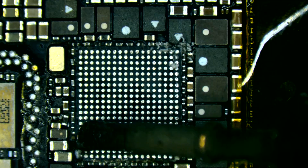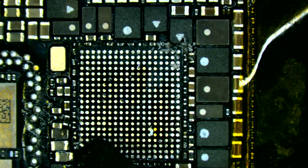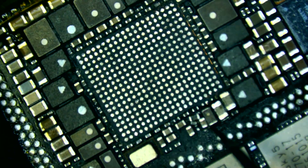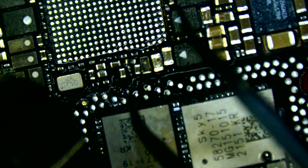Using PCB cleaner or even isopropyl alcohol with a brush and a microfiber cloth, you'll be able to clean up any of the flux residue to leave you with a nice clean surface that the IC can be soldered to. Then you want to take the time to realign any components that you gave up on earlier, such as these capacitors. The easiest way to do this is with some hot air and tweezers, or soldering tweezers if you have them. If you get frustrated with a single capacitor, you can always leave it for another time — just don't forget about it.